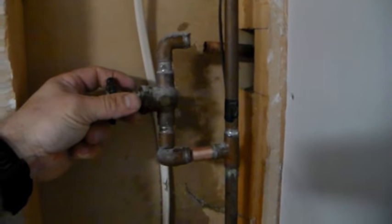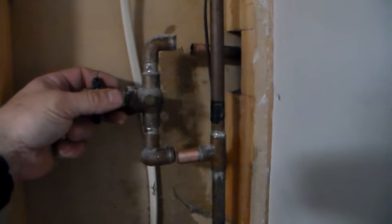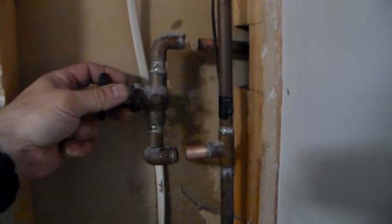Here's what we're working on today. This is a shutoff valve to the garden hose at the front of the house, and it's up inside the wall — the homeowner never knew it was here until I came in and gutted these walls. We're going to relocate the shutoff valve farther down where they can access it from the closet under their stairs. To splice into this copper without actually soldering, we're going to use a tool called ProPress.